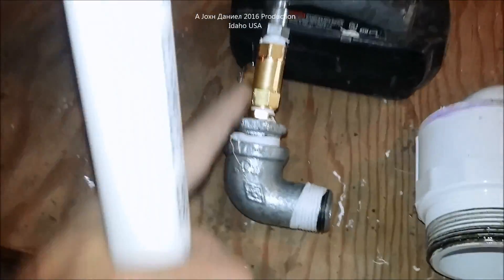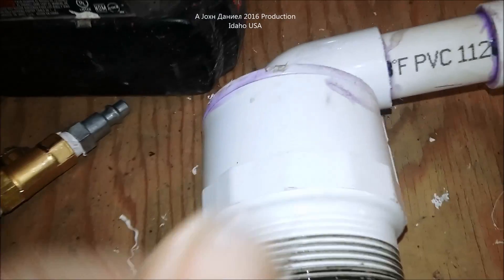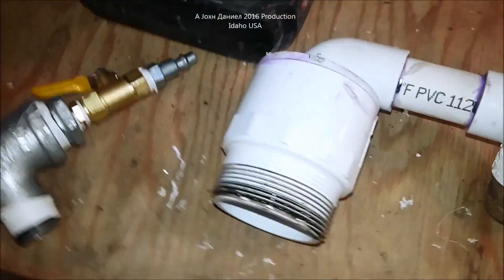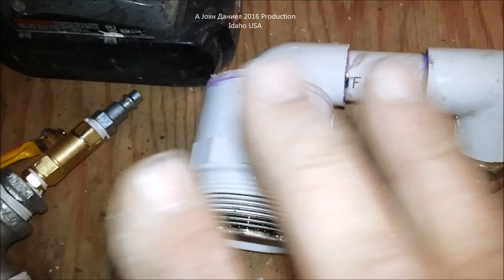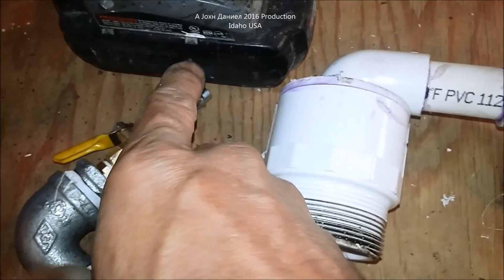I've removed this back out and made up my air inlet part. I went out to the drum and measured from the bottom to the top — basically measuring from this lip right here down to the bottom of the drum — then taking away a half inch, cutting and installing the pipe, then cutting away that half inch so it has a little play. Now we're going to glue this into that fitting and into this 90 right here to make it a solid, airtight joint. These plastic fittings will remain fairly airtight on that drum, and you don't have to worry about anything other than being very careful how you admit air. If you have a regulator, I suggest you put an inline regulator and set it at about 8 PSI.